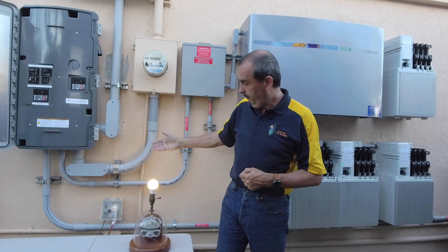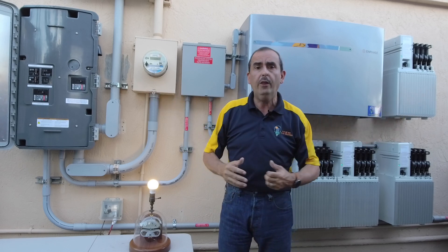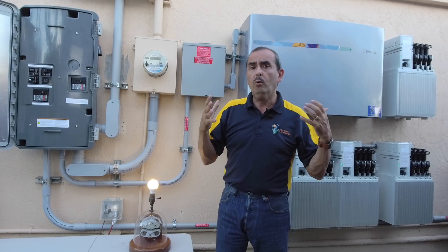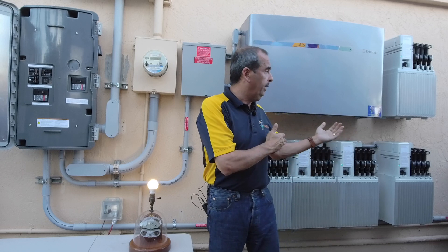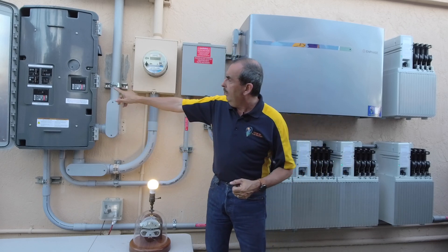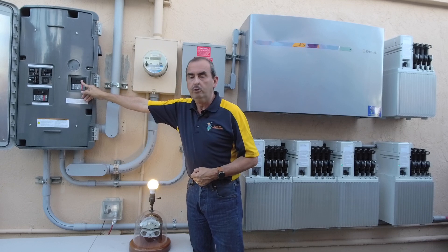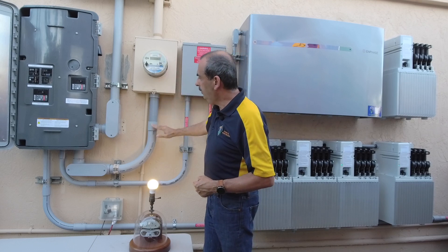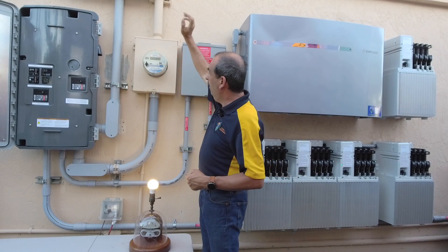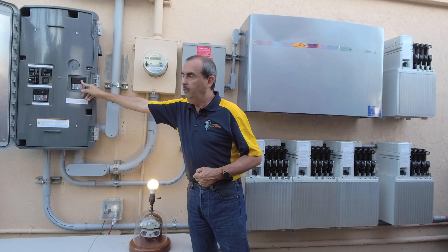We're going to demonstrate that now. As you can see here we have the transfer switch, and the lights show that power to the house is on. You can hear the air conditioner running. It's 5:30 in the afternoon on a sunny South Florida afternoon. We're producing around one and a half to 2 kW because the sun is almost down. Right now, solar panels alone couldn't keep the house running, but because we have the Enphase Ensemble system, nothing will happen and our home is going to continue to work. Here's my transfer switch — this is my 200-amp main breaker to the house. We're going to flip this breaker, cutting the utility. Power comes in from the utility, goes to the transfer switch, then to the batteries and out to the house. Solar panels on the roof come down to the Envoy, and from the Envoy to the transfer switch as well. Without further ado, I am going to turn the power off.